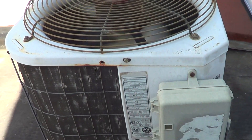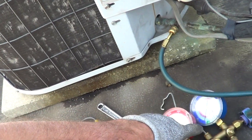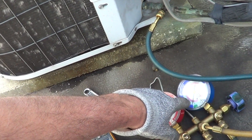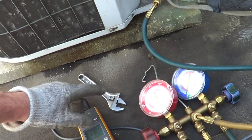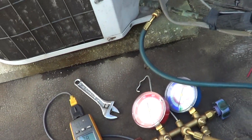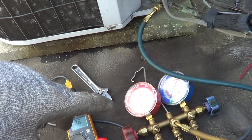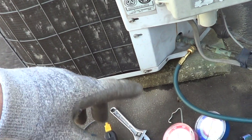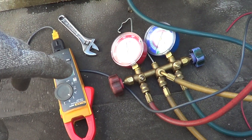Now your scrolls — a lot of scrolls on R-410A — you can't really do this. Scrolls have a pressure relief; they don't want to pump down to zero, it'll pop the relief. But usually on a scroll you can get away with doing this test to kind of tell, but on reciprocating compressors this test is really best suited. So that compressor is bad.